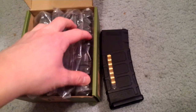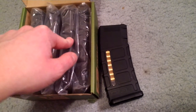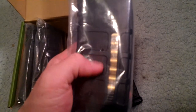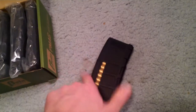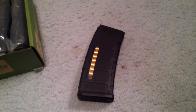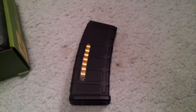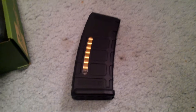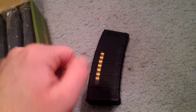I've only had one problem with this mag — it doesn't feed, or the lip got stuck in it. Easy fix: take the mag apart, release the spring, put it back together. It's rather simple. I'd give it a 4 out of 5, being that 4 out of 5 of the mags work. I assume once I wear it in, it'll begin to work. If there's a little thing, I'll just file it down.